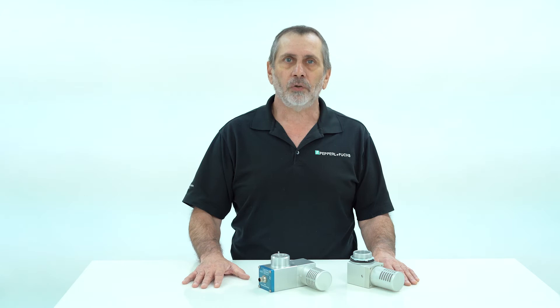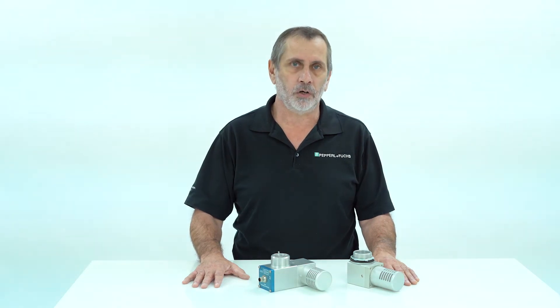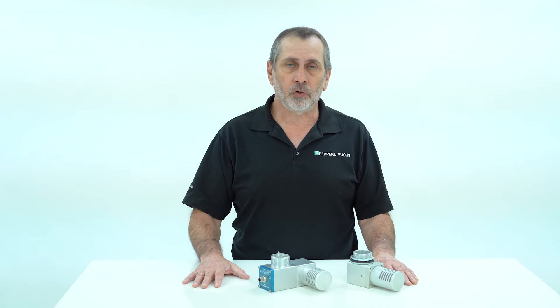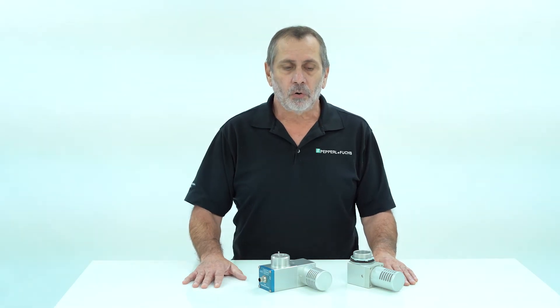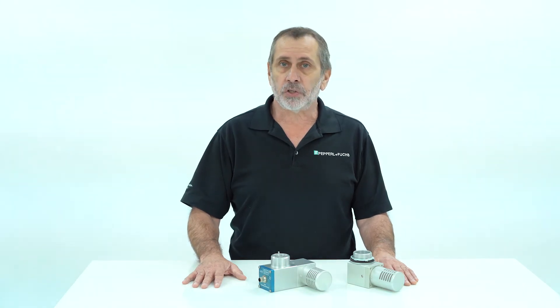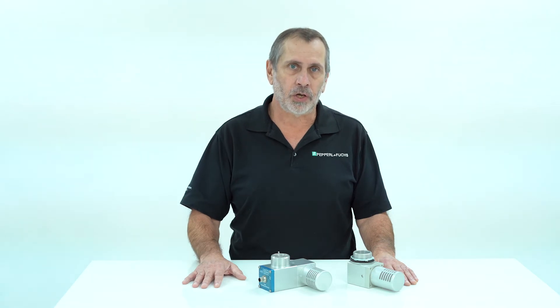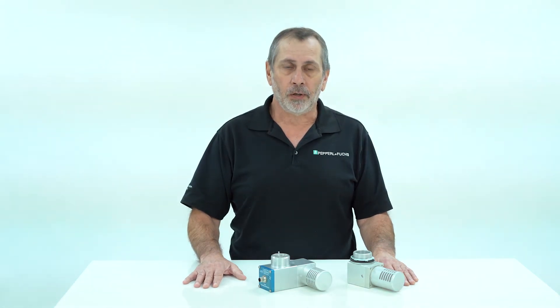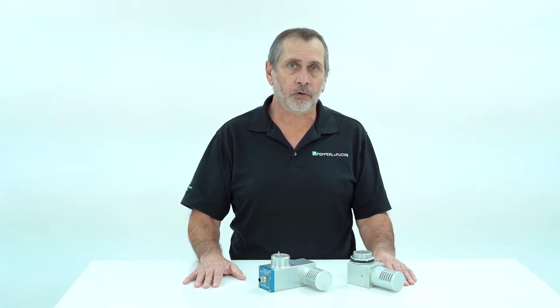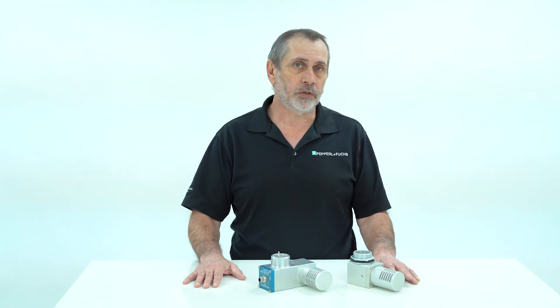So what is and why do we need a pressure relief vent when purging and pressurizing an enclosure? There are two main factors. One is purging the hazardous gas out of the enclosure. During start, you assume the enclosure is at atmospheric pressure and hazardous gas is within the enclosure. You need to purge out that hazardous gas with a high flow rate of air or inert gas that's clean, and in order to do that you need a pressure relief vent — something for that air to flow through and escape out of the enclosure.